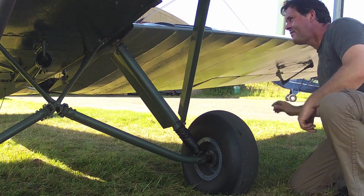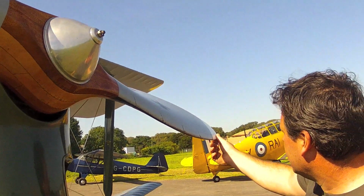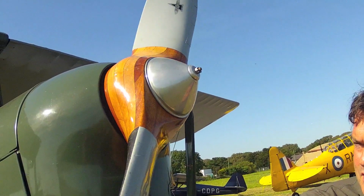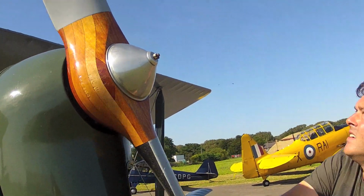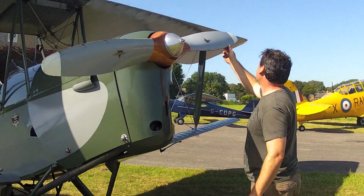When it comes to the propeller, have a good look at its leading edge for condition. If it loses one of the little brass caps, it will give an inordinate vibration in flight, such that it may feel like it's taken the engine out of its bearers. If you turn the propeller backwards, you run the risk of the engine starting on its own.